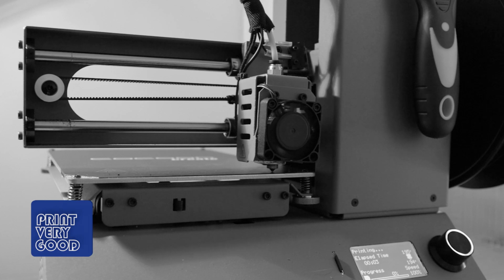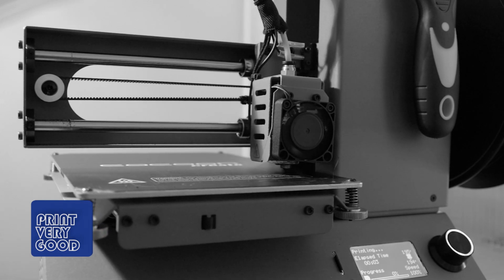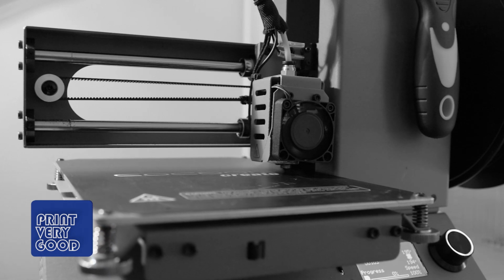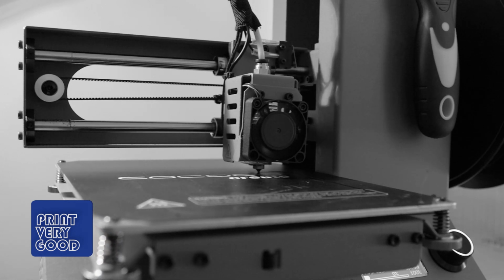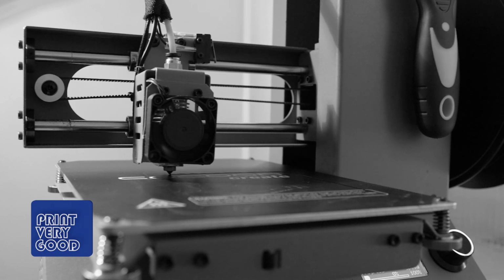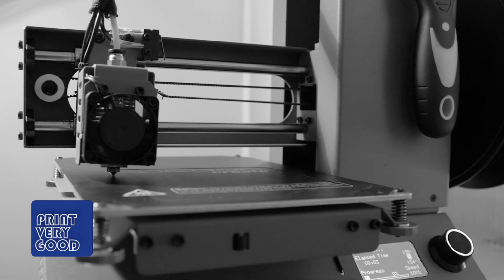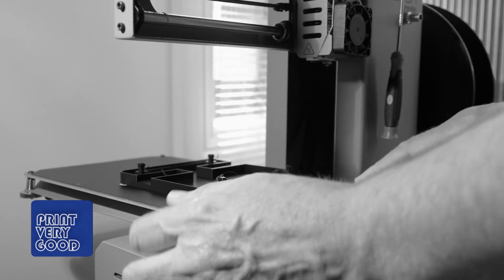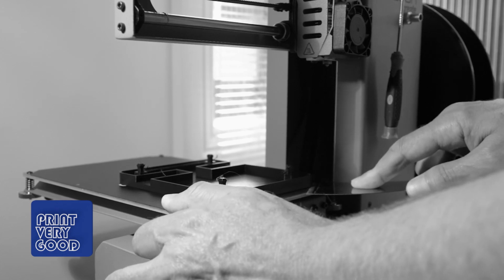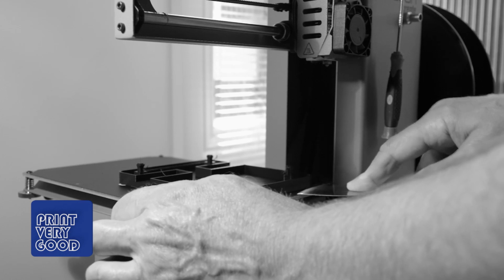The third thing I do is I print my first layers slow, 15mm per second for the initial bottom layer and 15mm per second for the top and bottom layer settings also. I really want to make sure those layers have time to bond. Unfortunately, the top and bottom speeds are tied together in Cura 16.04, so the top layers get printed slow as well.